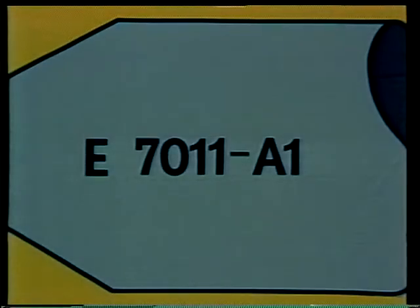The last number of the code gives the type of power supply that should be used with the rod. This reading is based on the diameter of the electrode rod. A suffix at the end of the AWS number code will indicate if a special alloy is contained in the rod. You can find more information on electrode rod identification in your text, so be sure to look it over.